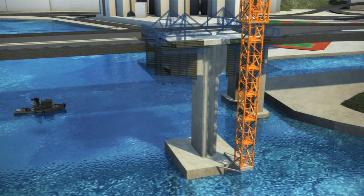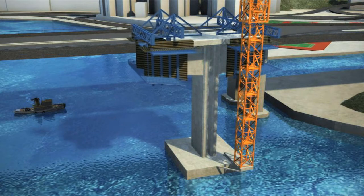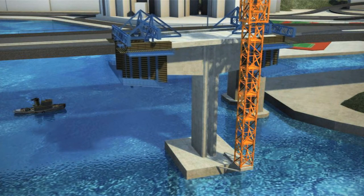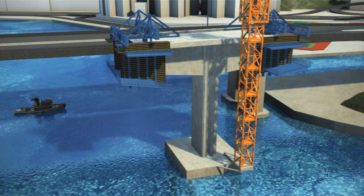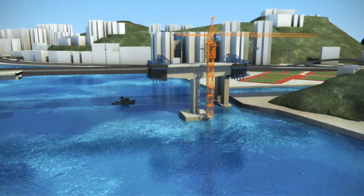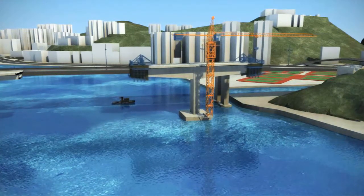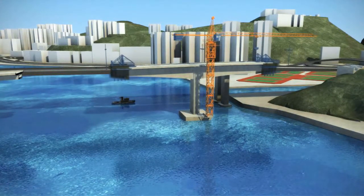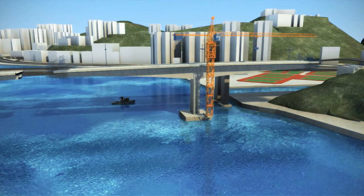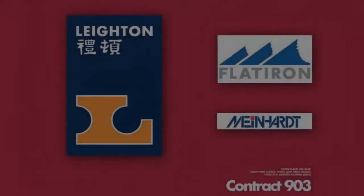For the bridge pier construction, we will use a proprietary jump form system utilizing cast in-situ construction. This will provide short pour heights, thereby reducing safety risks and increasing the quality of finish. Our proposed method allows for a larger than normal pier table onto which the travelling forms will be installed. This has the benefit of the pier being only a half section out of balance rather than a complete section, thereby reducing the amount of rebar required in the pier and potentially reducing the size of the foundations.